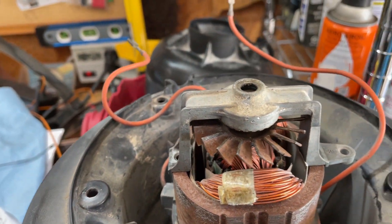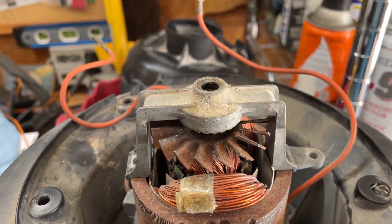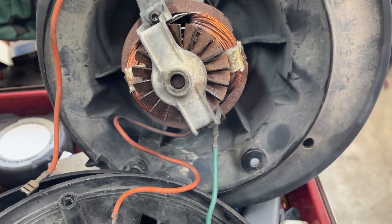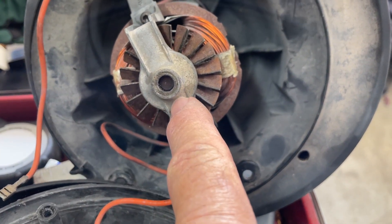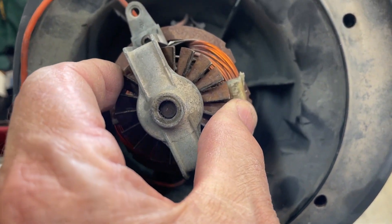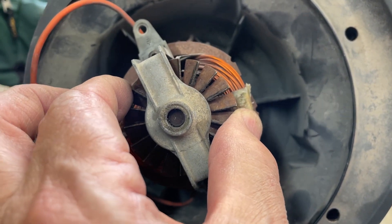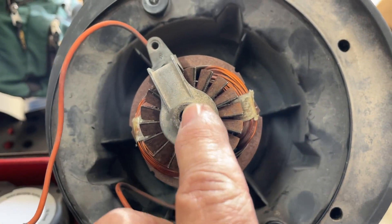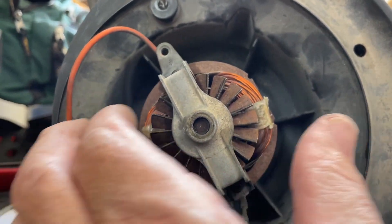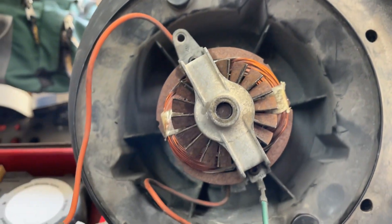Now I've got a new ball bearing up here instead of that bronze bushing and felt oiler ring. This motor comes with a ball bearing at the bottom; I've put a new ball bearing up here to replace the bronze bushing. There's no free play in there at all — I can't move that shaft side to side. When I had the old bushing in there, which was worn out, there was radial side play between the shaft and the bushing. But this is dead solid.